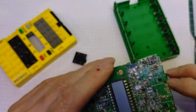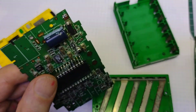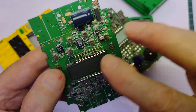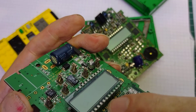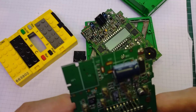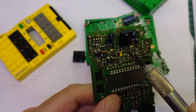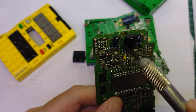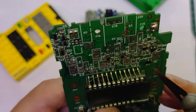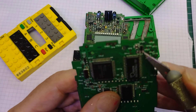It doesn't look to have a piezo sounder on this one, whereas this one of course has its piezo sounder down here. The reason we can't see it on this board is it's tucked away, along with the LCD driver chip, underneath the LCD - and that's where that happens to be. Another interesting thing is on the old one they used a surface-mounted chip or transistor here to drive the LEDs, whereas on the newer board they actually went for a through-hole transistor up there - so that was a through-hole component coming through this side.